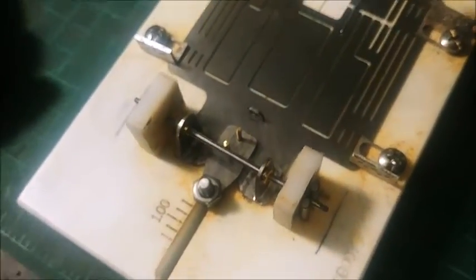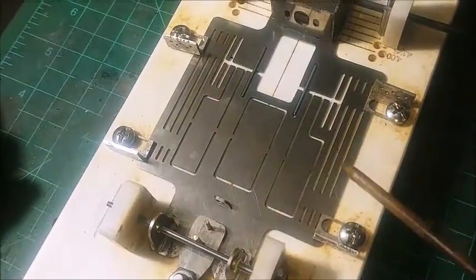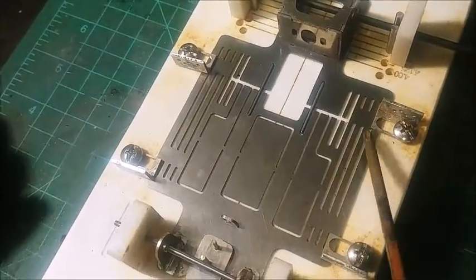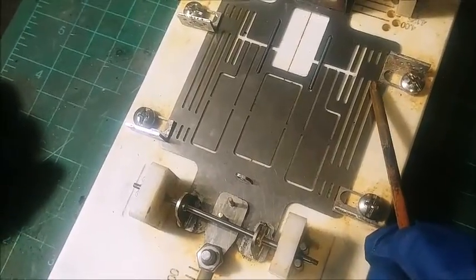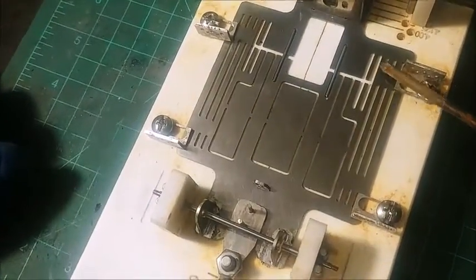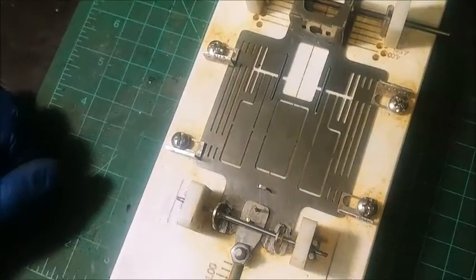And then one other option that you can do, you can assemble this chassis completely without wire, but I did add some 063 rails because later on this chassis is going to be a little bit more of a blueprinted special. I'm going to end up doing some cuts there that's going to provide a little bit more bite to the chassis. So the chassis will basically be held together by these two rails and then these two rails that are integral to the chassis cut. All right, so soldering.